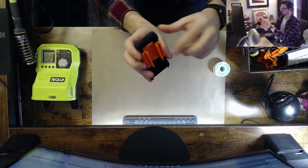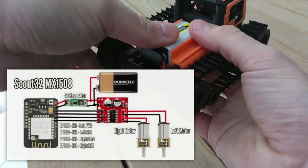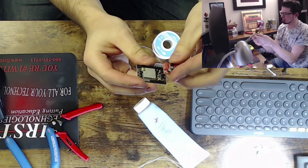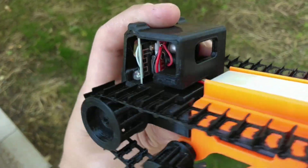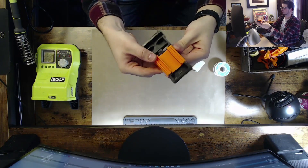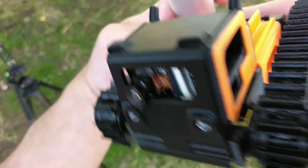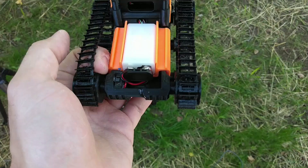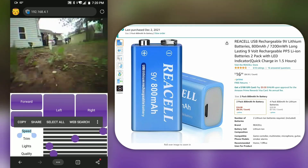I built my own test rig to work out all the bugs. To simplify things a bit on this N20 build, I omitted the charger circuit and the LiPo, opting instead for a 9V battery. I run the MX1508 motor driver directly from the 9V with an additional 5V regulator to step down voltage for the ESP32. I was able to tape the motor driver to the back of the ESP32 along with the 5V regulator, so now all the electronics fit in the cab. For a cleaner look and to take advantage of the extra space in the rear, I even whipped up a special 9V battery clip to replace the stock bed. If you still want USB charging, there are also these fancy new 9V batteries that are actually just a 2-cell LiPo in disguise with a built-in charger. I have links to these in the description and a manual for these batteries if you want to try them out for your own projects, as they are actually really cool and easy to implement.